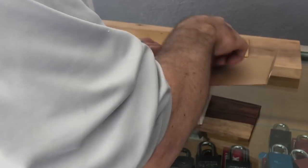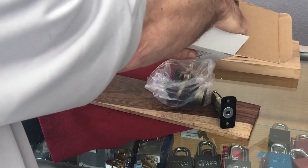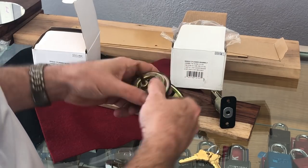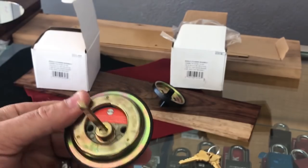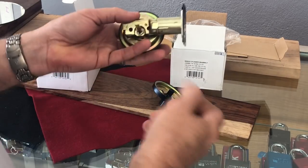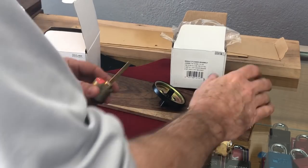We're going to take out the older version because these look exactly the same, and we're going to show you what we're all familiar with. Anybody who has used Schlage by Dexter — which is Builder's Quality, a less expensive option — will recognize your standard cross-style tailpiece with the flat bar that goes through. This is very common of LSDA locks, which we've done plenty of videos on. When you turn your key, it throws the deadbolt via that flat tailpiece.